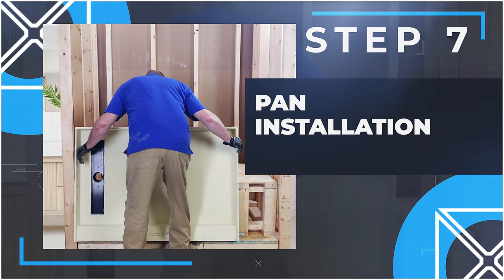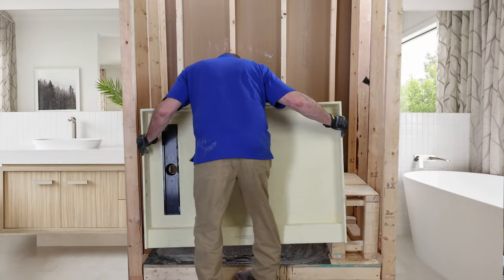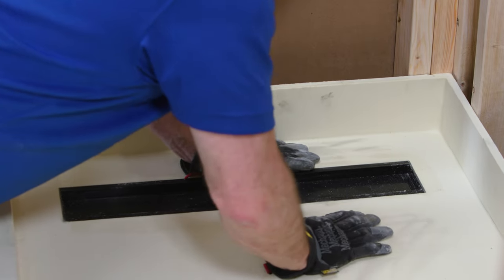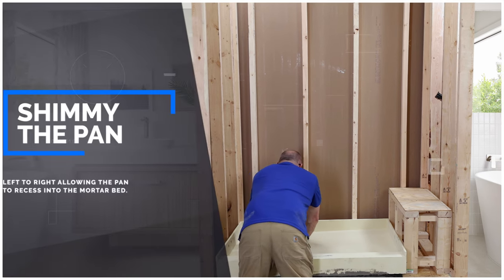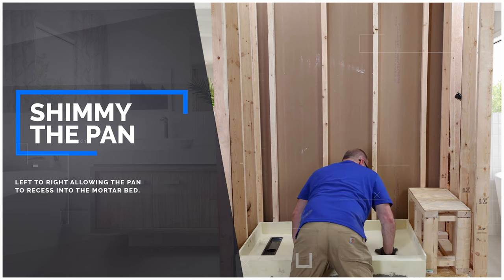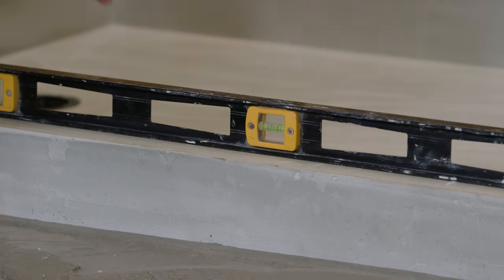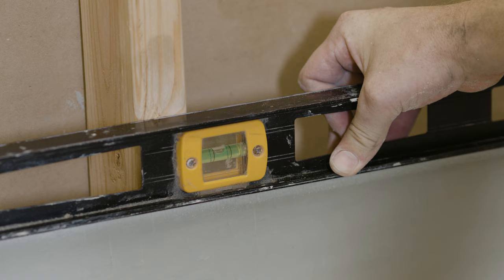Step 7: Pan installation. Now that your mortar bed is laid out and measured to ensure proper depth, place the pan against the wall, lowering it evenly into the mortar bed. The first place to apply down pressure is the drain, because that is the lowest part of your pan where water will drain. Work your way through the rest of the pan — shimmy it left to right or front to back, dependent on your pan's rib foundation, allowing the pan to recess into the mortar bed. Using your level, ensure the pan is level left to right and front to back along your splash walls, and left to right along the curb. Do not use the inside of the pan as an indicator since the pan is pre-pitched and not meant to be level.